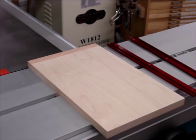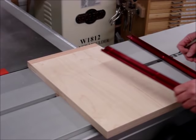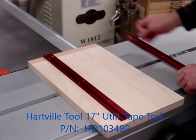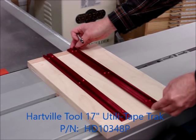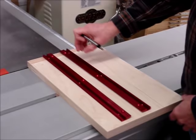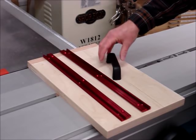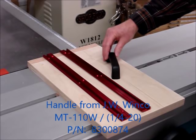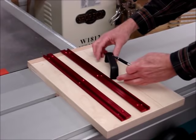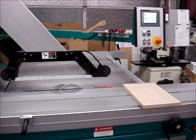The next step is to decide where to cut your Fritz and Franz jig into two pieces. I've decided to deviate from what you'll typically see and I've purchased some T-tracks with a strip available for self-adhesive tape. I'm using the T-slot so I can put adjustable stops with a scale to use this as kind of a parallel fence assembly. I'm planning on having a handle that straddles the runner in the T-slot, so I want enough space here — I think I'll split the workpiece at about 175 millimeters.